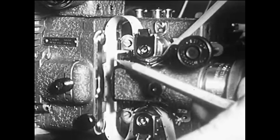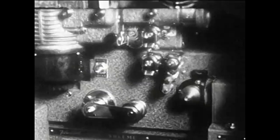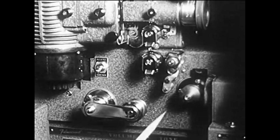But see how these plates are made. A wide path has been hollowed out for the pictures to go through, and another has been made for the soundtrack. The important areas of the film are not touched at all. Other parts of the machine, the guide rollers, sprockets, and the sound drum turn with the film, and so there is no friction.